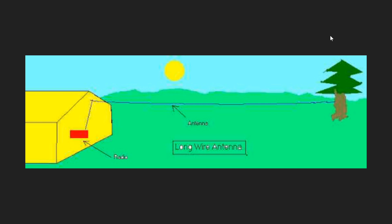It's the cheapest form of antenna. If you live in a quiet environment, it's probably the only one you'll ever want or need. The rule of a wire antenna is: the longer the better. But remember, a lot of portable receivers have a hard time with very long antennas — they will often overload, as they're not designed to be used with such large antennas. Desktop receivers, however, will enjoy having a good wire antenna.